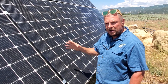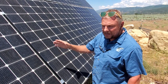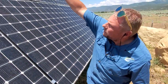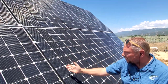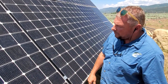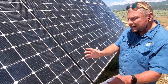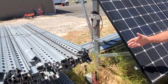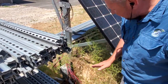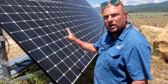So 10 panels at about 300-something watts. If you put a 550 watt panel on, that is almost 92 inches long — way longer in length — and it's going to be 40 to 44 inches wide, so wider than this. You could do it but you're going to run out of space on the sides. You can also lengthen the edges with some unistrut — you can cut the unistrut and add pieces to the side to make it a bit wider. It's very flexible; it's a framework for you to tweak if you have to.